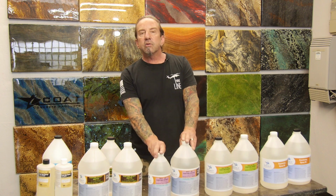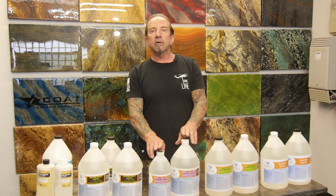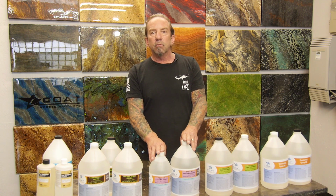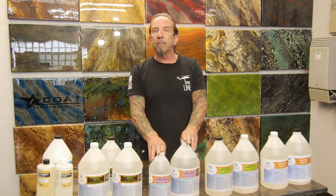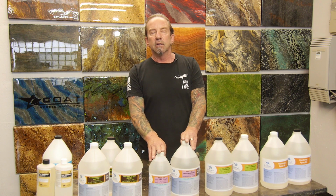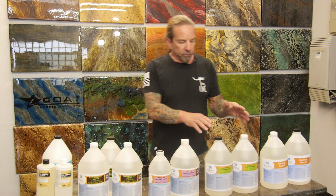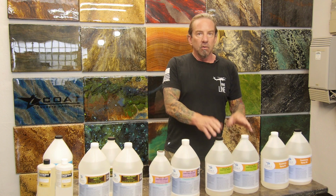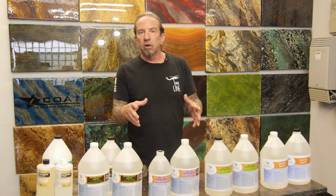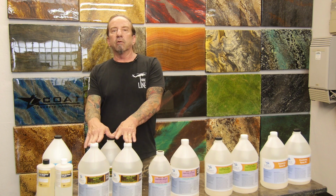Moving on. This is a 2-to-1 casting epoxy. It's very slow. So you can expect to leave something in a mold for a couple of days, maybe 3 or 4, depending on the application and the depth. This one's designed for high mass applications where you've got more volume that you need to cover. So if you're going up to 1 inch with this, smaller volumes. 1 inch with this, bigger volumes. They work very well. This is one of our crown jewels.